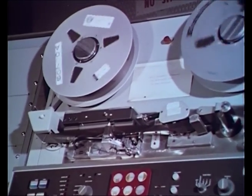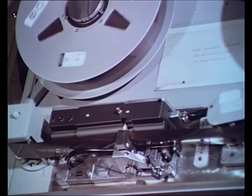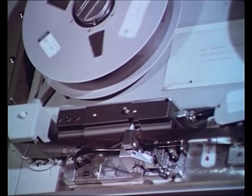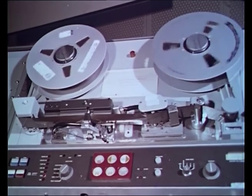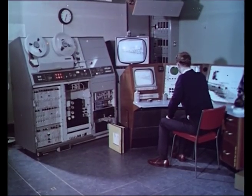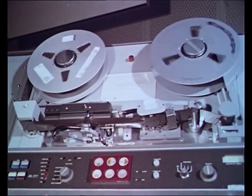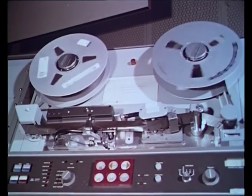What happens is that a signal is recorded onto the cue track of the tape at the point at which the edit is to be made. There is no physical cutting of the tape involved, and the machine makes the necessary compensation for the sound displacement. When the tape is rerun, the machine will switch at this point from playback to record. However, in order that the position of the cue signal is exact, this changeover can be rehearsed on the studio monitors and altered if necessary.